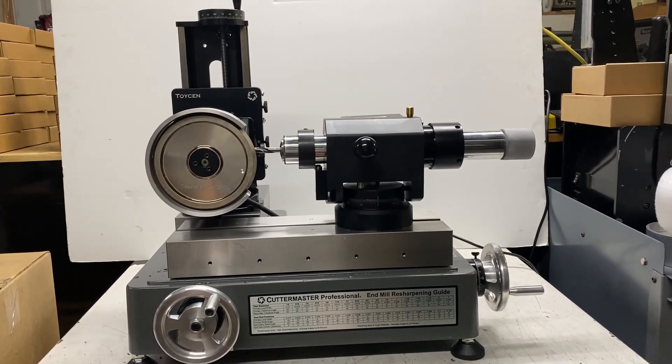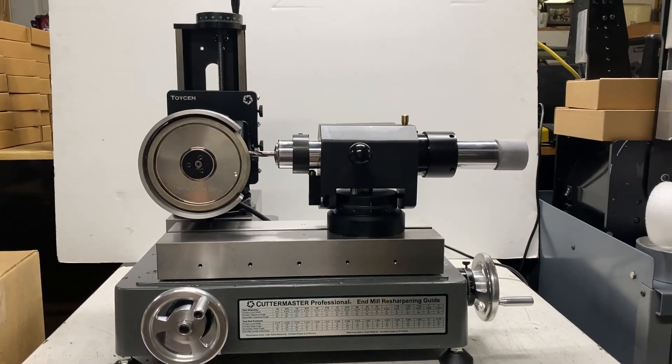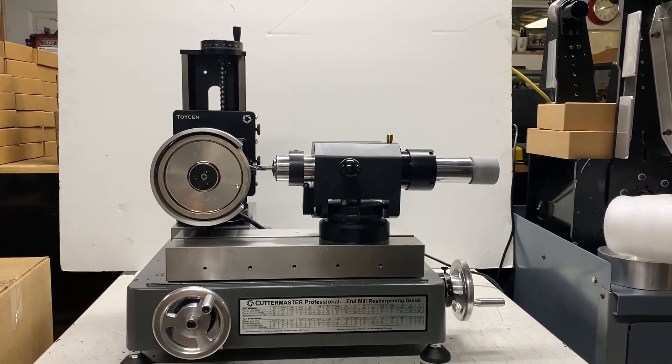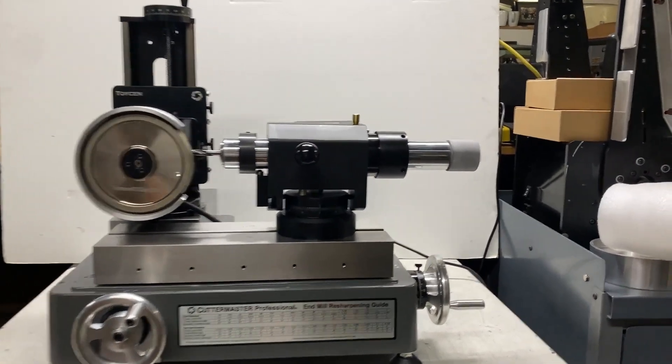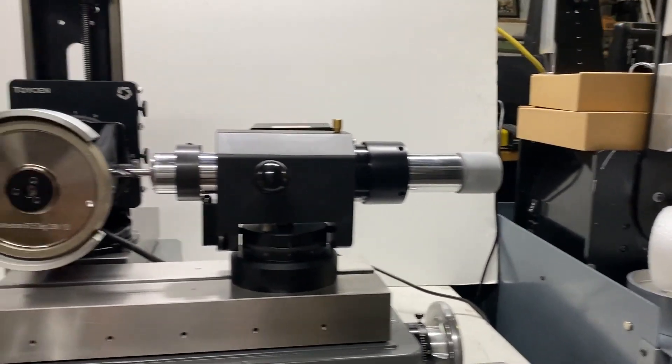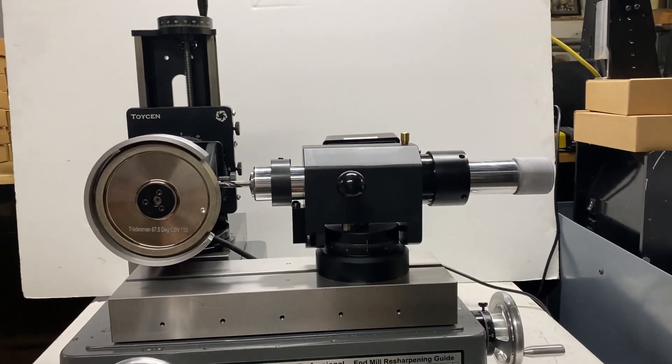For this operation for the step drill we chose a 2 flute cam. It's a standard Cuttermaster cam with a 65 thou lift. On the back you have the spring housing, on the front you have a cam with a cam follower. The spring housing keeps tension on the slope of the cam.